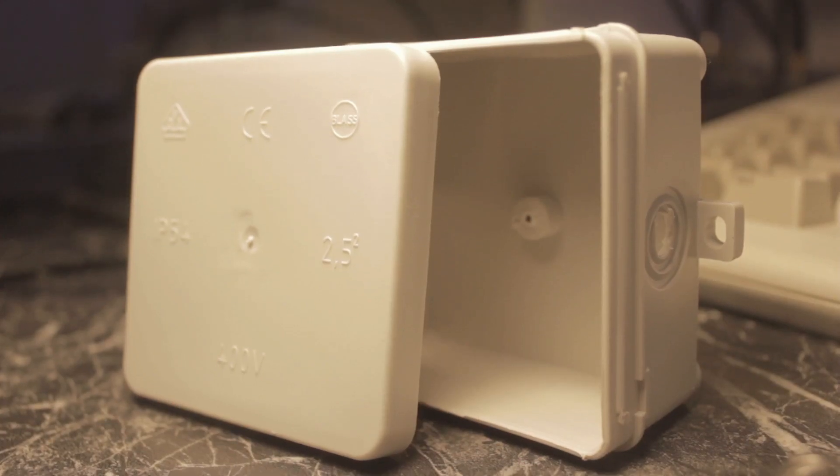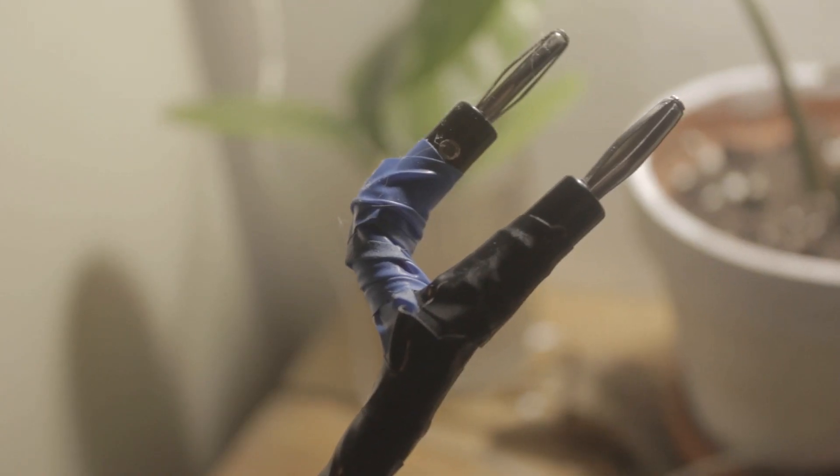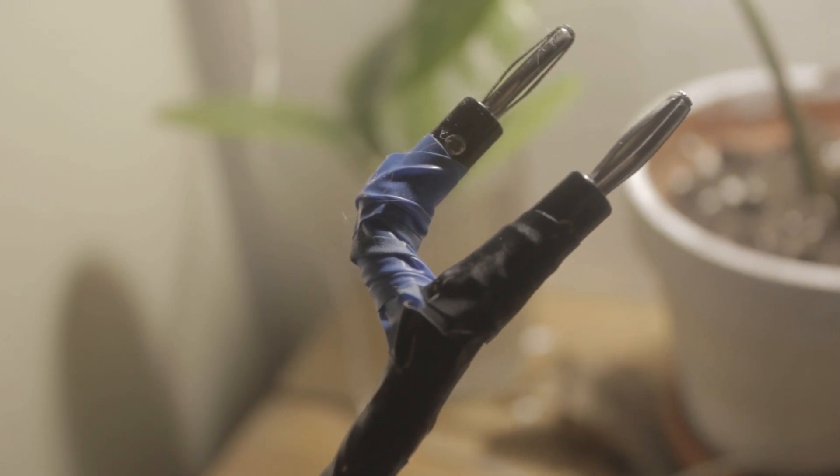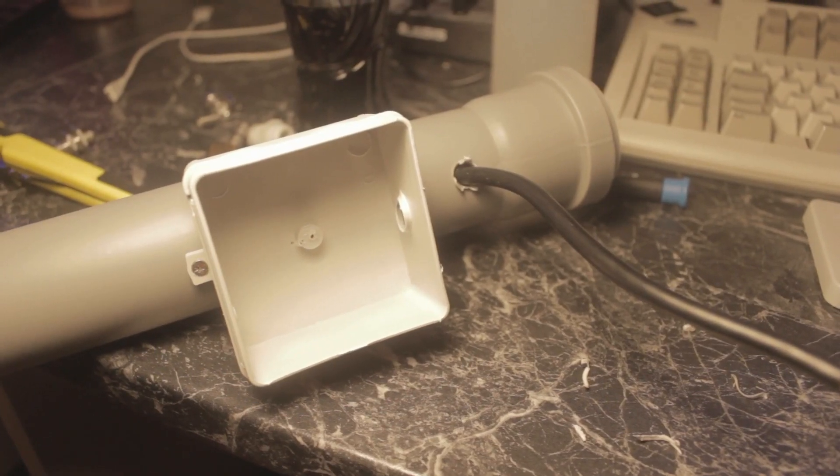I also used a chock block and 10 meters of RG6 coax cable. To connect it to my device, I'll use this box and some banana plug connectors I already had lying around. This will enable me to have a length of coax with plugs on the end. I can plug into the antenna when needed, and if I make future antennas I'll make them the same way, so I can just use the same connecting cable. It may not be the best way of doing it, but it's all I have for now — and in fact, the whole project can pretty much be summed up by that one sentence.